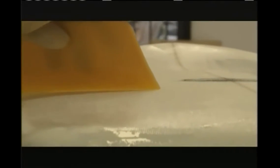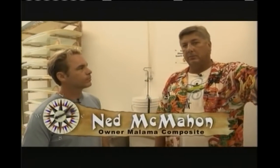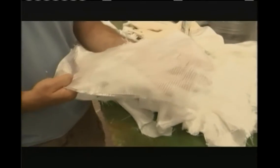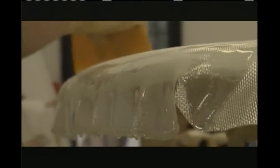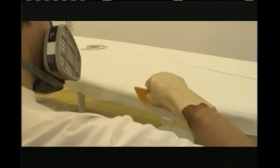Turn it? A surfboard is being glassed right here. This is the first step that occurs after the board is shaped. What we do is wrap the board in a cloth. This particular board is made out of fiberglass cloth, and Micah is just pouring resin on it, which is the thing that glues the cloth to the foam core. So he's just glassing the deck of that board. And here's where some other greening things happen, though.